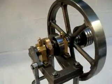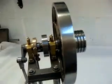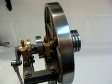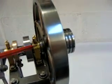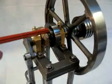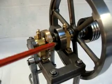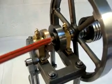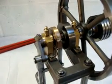Here we have the crankshaft, supported on four steel columns, which carries a drive pulley on the outside edge, a flywheel, followed by a bearing with an added oil cup for lubrication. This is a balanced weight, machined out of a solid piece of steel, to try and reduce the vibration when the engine's running, because it does tend to wobble a bit at speed. There's the eccentric, another bearing, and there's the crank.